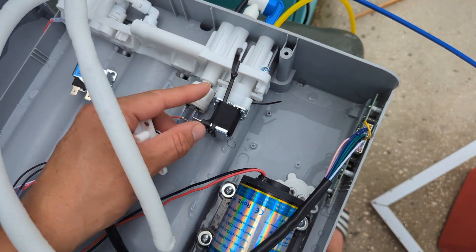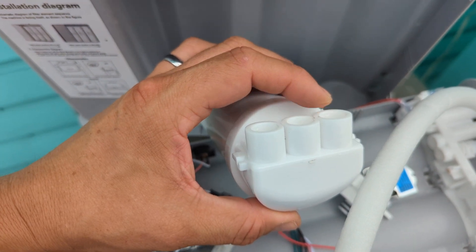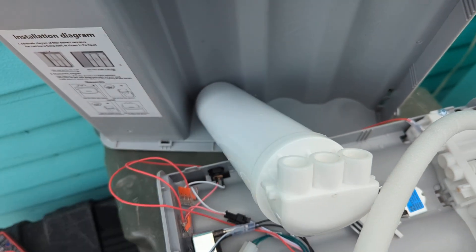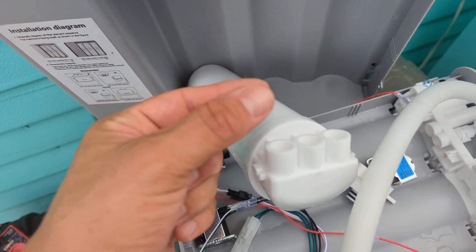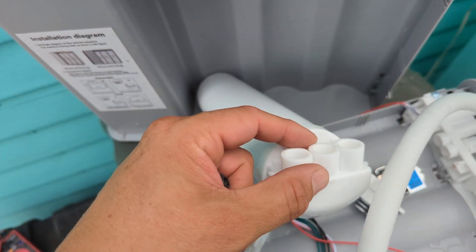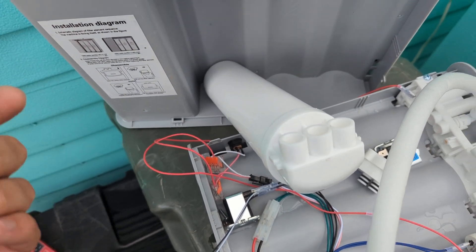Not only do the holes not match up, but it doesn't allow for that tiny hole to bypass the system. The way a reverse osmosis filter works is that water goes into this side and tries to come out, but when the valve is closed that hole is really tiny, which causes pressure to build up and then forces it out the pure side. Without that tiny hole to allow some brine to escape, it forces all the water through the membrane, giving a very small flow rate and clogging the filter quickly.